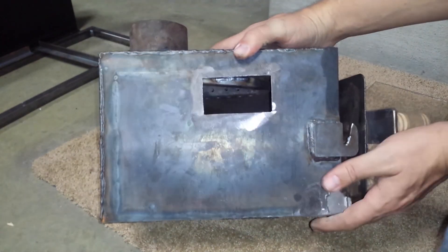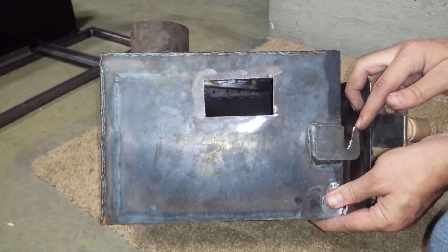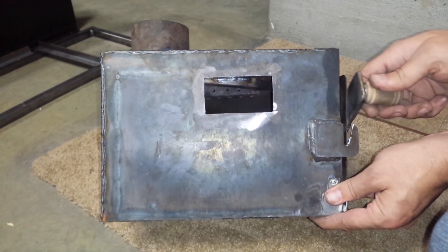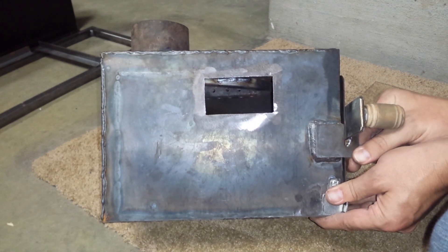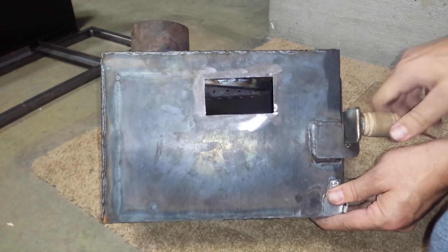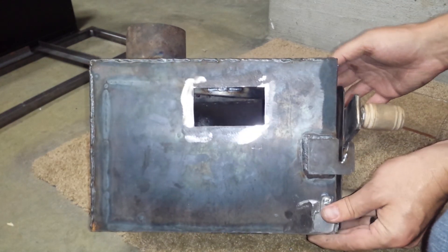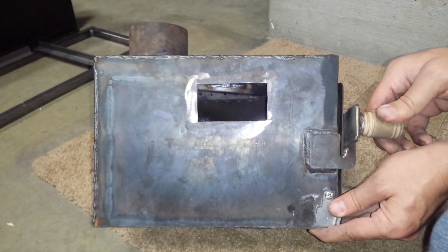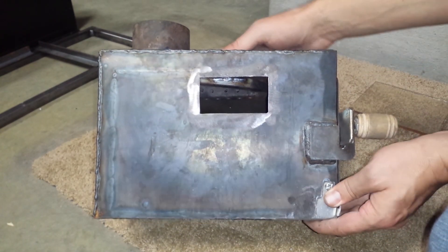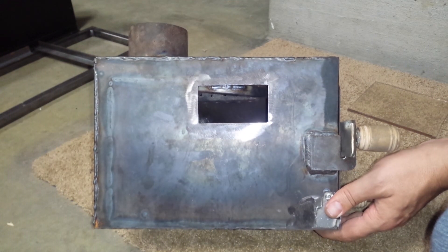The final change I made on the stove — until I can get the ceramic glass cut — is that this latch piece is now angled. It was straight before, but when the stove gets hot it expands enough that I was having a hard time opening and closing it without pliers. I put this angle on it so I can shut it at a variable degree depending on how hot it is. When it's cold I can leave the door slightly ajar, and as it warms up I can shut it as far as needed. On the final product I plan to use fiberglass rope for the door seal.